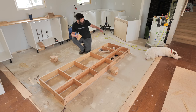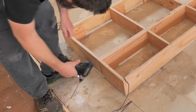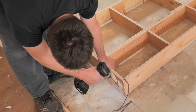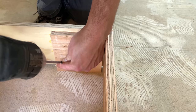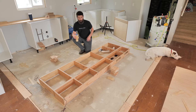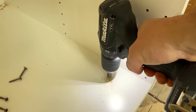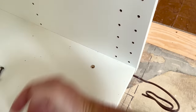I put a couple of pocket holes on each end that I can screw into the plywood to hold this island in place. You don't need pocket holes — you could put a little toe screw in there or even use some kind of an angle bracket. I kind of like putting it on the outside so that once the cabinets are secure you can adjust accordingly if you need to. To secure the cabinets onto the kick, put a couple of screws — maybe four or five — through the cabinet into the edge of the plywood. Just pre-drill the hole so you're not going to split your plywood.